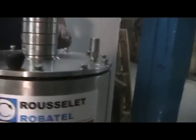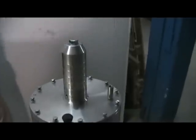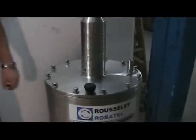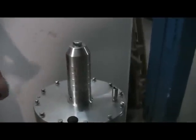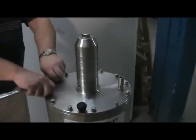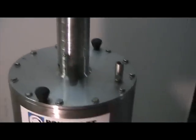There remains a space between the casing and the top cover. That space will disappear after the top fastener is tightened. With the top fastener secure, you'll see that the cover rests gently on the casing. You can now fasten the casing bolts. With all the fasteners in place, we should be able to turn the coupling.